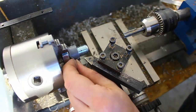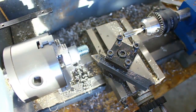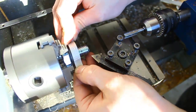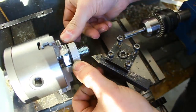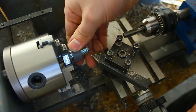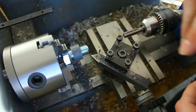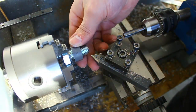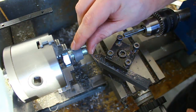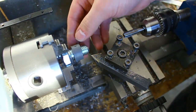Okay, it's getting stringy, which means it was already too hot. Let's test it with the tool — pretty good fit, I think this is okay. Yeah, this is actually already gripping it, so this is a good fit now. The OD is now done. It's filled with all this stringy stuff which I'm going to clean out later with a scraper — it's much easier that way. I'm going to clean these edges as well so it doesn't have all this stringy junk on it and it's going to look nice for the customer.